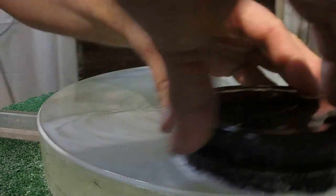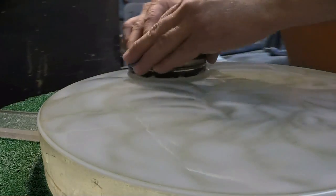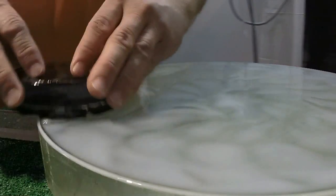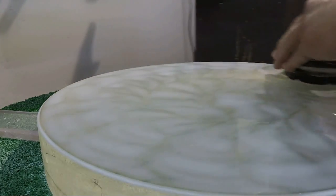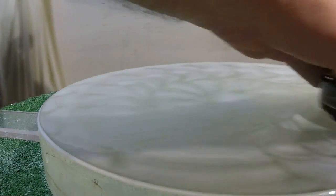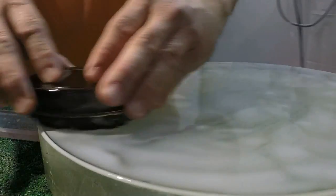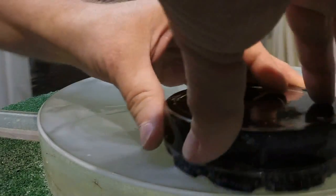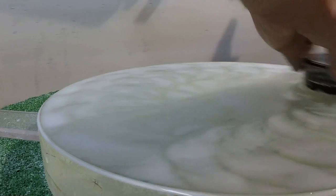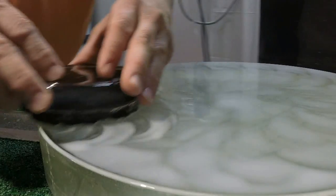You don't want to put any pressure on the mirror when working out there — basically just the weight of the polisher itself, with fingers just on there to guide and keep it in control. Those are the general types of techniques you use when trying to plane down the high spots on a mirror. We're pretty close to being a good mirror at the quarter-wave to sixth-wave range. To get to that twentieth-wave that we'd like to see, you have to go slowly and give whatever zone is high just a gentle taste of a stroke. Keep sessions short, do a lot of testing, and just slowly but surely plane down the hills — eventually you end up with a nice smooth mirror.